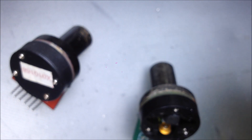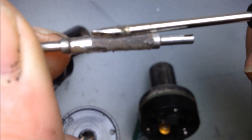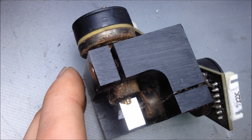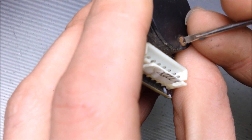Let's take a look at the inside of the galvo's construction. I've partially pulled this apart. Inside it's composed of two electromagnets. Here is a badly damaged one — a permanent magnet as well, badly damaged. Then we have a north pole and a south pole. Let's pull apart another one and see how it looks. These are both very old and very dirty, and they need new bearings. I'm going to pull one of these apart just so you can see while they're assembled.